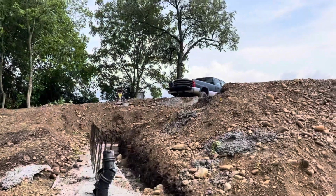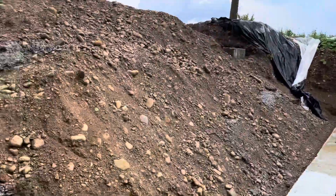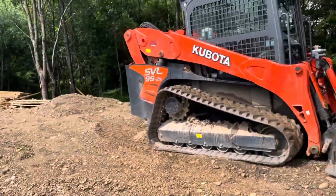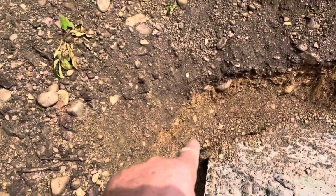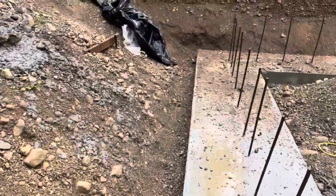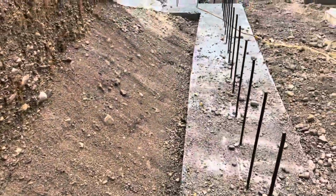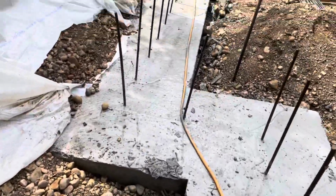Okay, just got done raining. Now the sun's out immediately. Just one of them pop-up showers. So I need to show you what I'm doing. So there's the garage. I'm down in the basement, and I'm getting ready to put in, we call it the footer drain. So this is the outside of the footer. I'm gonna dig a trench, which I've got done, going around here and all down through here. My 4-inch corrugated, not PVC, just corrugated black pipe. I call it ADS. We'll go in there and I'll have a sock on it.